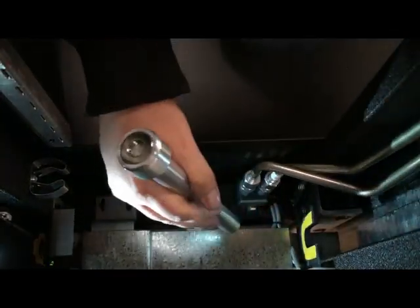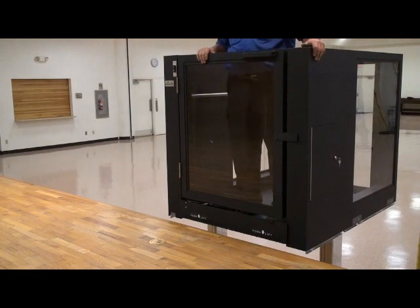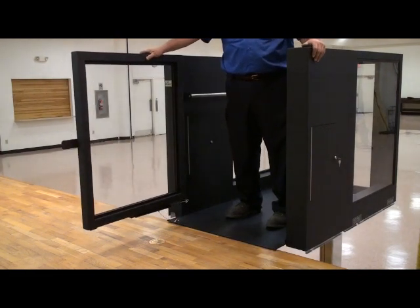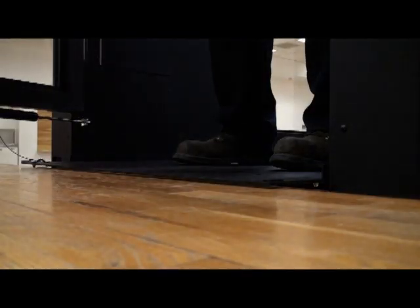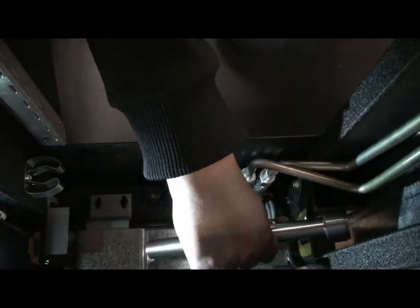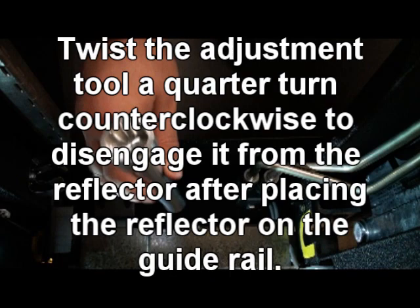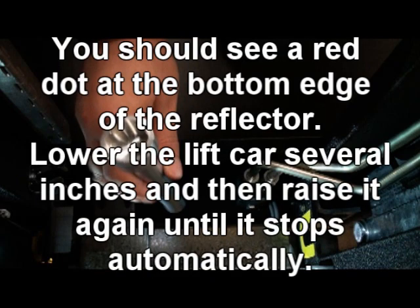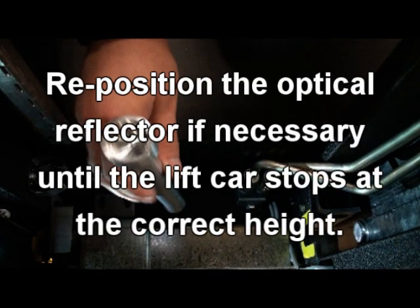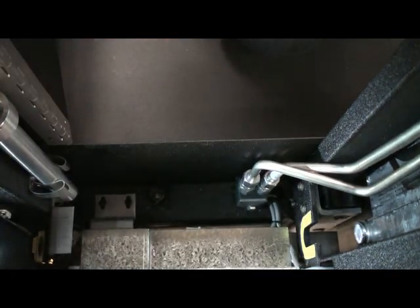Pull the reflector off the guide rail. Use an operating switch to move the lift car so the lift car floor is approximately level with the upper landing. Open the upper landing gate completely. Verify that the dock plate rests securely on the upper landing and provides a smooth, level, and safe transition to and from the lift car. With the lift car at the correct height, use the height adjustment tool to reattach the reflector to the vertical guide rail. Twist the adjustment tool a quarter turn counterclockwise to disengage it from the reflector after placing the reflector on the guide rail. You should see a red dot at the bottom edge of the reflector. Lower the lift car several inches and then raise it again until it stops automatically. Reposition the optical reflector if necessary until the lift car stops at the correct height. Return the height adjustment tool to the tool holder in the left-hand machinery cabinet.